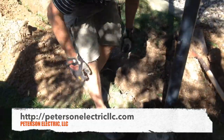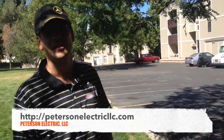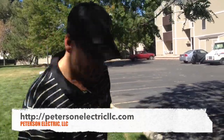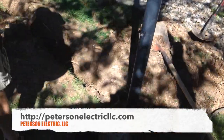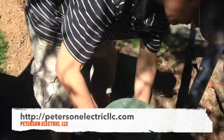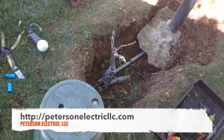It is UF cable but I did sleeve all of it in three-quarter conduit to keep it safe. We put the trench at 19 inches deep right here — it's not quite as deep over here because I built it up so I could go with my manholes. I'll slip this right over to show you how this will look.